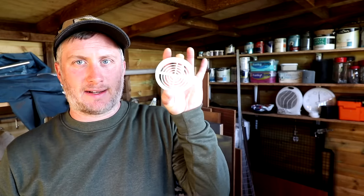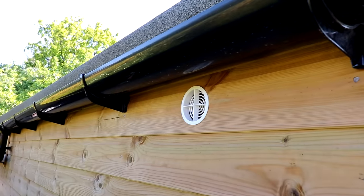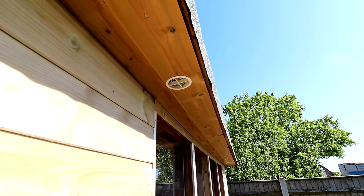In some areas there were still some mould spores visible, and I've been back over those with the spray a number of times. I think it's just stained at this point and I'm not sure there's much else I can do — I doubt I'll bother painting the ceiling since this is just a storage shed. To fix the underlying problem, I added some soffit vents to the back wall and to the soffit above the front wall too, meaning lots of air can now pass through not only from one end to the other but also across the shed. Hopefully we won't have a repeat this winter. If I hadn't noticed the problem soon enough, the plywood ceiling would have started to delaminate, warp, twist, and eventually fail.